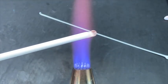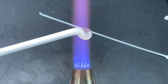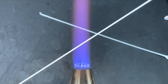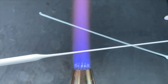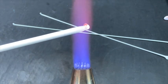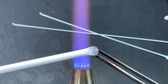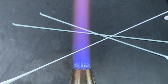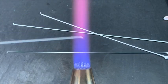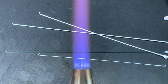Be very careful not to touch the stringer with your hands — it's going to be hot for a few moments. Now I'm going to heat up the end of the rod again and pull a section of stringer that's just a little bit thinner. I'm going to do three different thicknesses of stringer today. I'll pull this one a little faster and stretch it a little farther so it'll be thinner than the first one. This one's going to be a lot finer, so I'll do a very small gather of glass, hold it just above the flame to cool it slightly, grab it with the serrated tweezers, and pull a little more quickly and further apart.